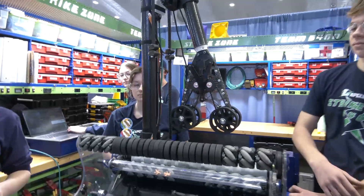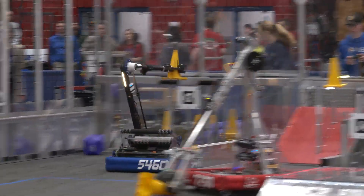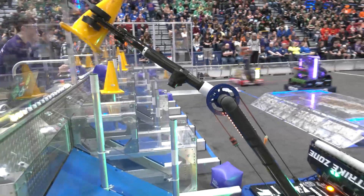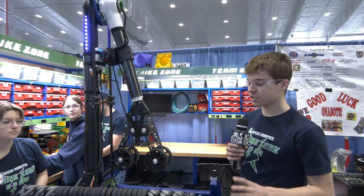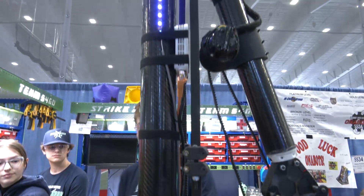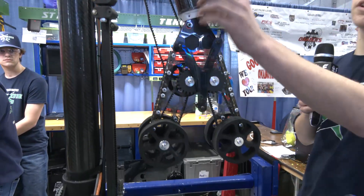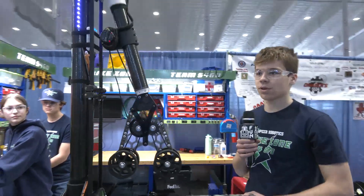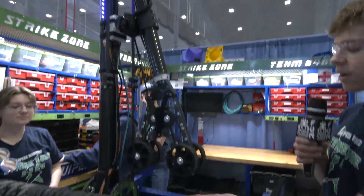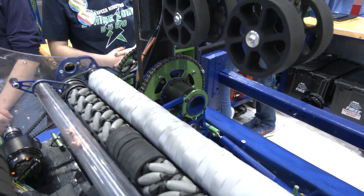Let's keep moving on the robot and talk about your arm and claw area. Some teams are just doing carbon fiber wraps on their arm, but this is a huge diameter carbon fiber tube, so I'd love to hear more about this whole overview and what's gone into it. So with our carbon fiber, we knew from the beginning that our entire upper structure needed to be as light as possible, because in the past we've had some CG issues. We really wanted to prioritize a low CG. We ordered this carbon fiber from a supplier in Wisconsin, and all of the inserts were either epoxied or hot glued in, and we found it holds up really, really well. We drive everything from down below in a gearbox right down here — again, all for CG. We were able to keep the whole upper structure, excluding the Falcon, under seven pounds.